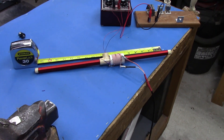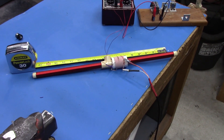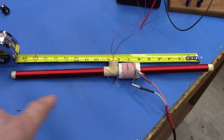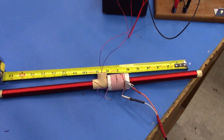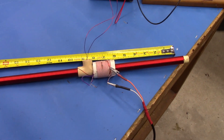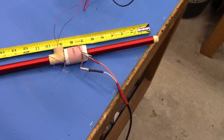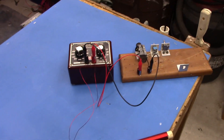Okay guys, I'm back. I've got to do this handheld because I just can't set up the tripod and it's late, I haven't eaten yet - W1VLF gets pretty grumbly. You knew this wasn't going to be pretty, but there's essentially the coil. It won't really look like that - this middle piece won't be here, this was a kind of an in-house portable thing that I was building. I have a coupler coil that fits on top of it to sample, and I have a couple of different taps that allow me to get the maximum out of the antenna. This thing shows about 18 inches but it's really going to be only 16 because this middle piece won't be in here.